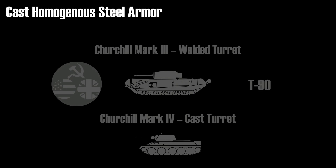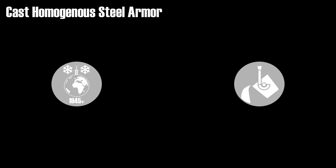But back to World War II. In general the Allies used more cast turrets than the Germans as the war progressed. After the Second World War, cast turrets became almost universal for main battle tank turrets. Since the 1950s it is also common to cast complete hulls. Nevertheless, as mentioned before, even current tank models also use welded elements.